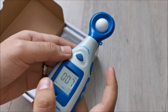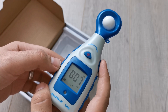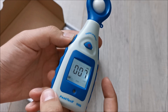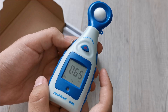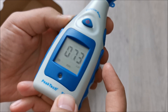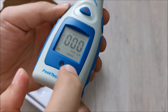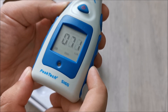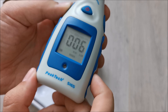So yeah, it doesn't work as I thought — where you press and it shows that value. It locks onto it, so you press it before taking the measurement. And yes, this works. Depending on light level, you can see when it doesn't have enough light the backlight turns itself on. From here we change the range. We are in 2,000 lux mode now, then 20,000 and 200,000 lux. But it's up to you to multiply what you see by 100 for the 200,000 range, and by 10 for the 20,000 range.